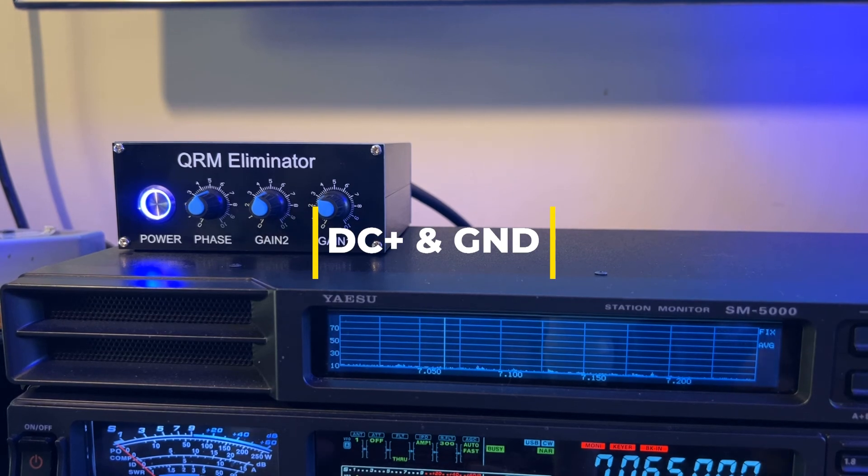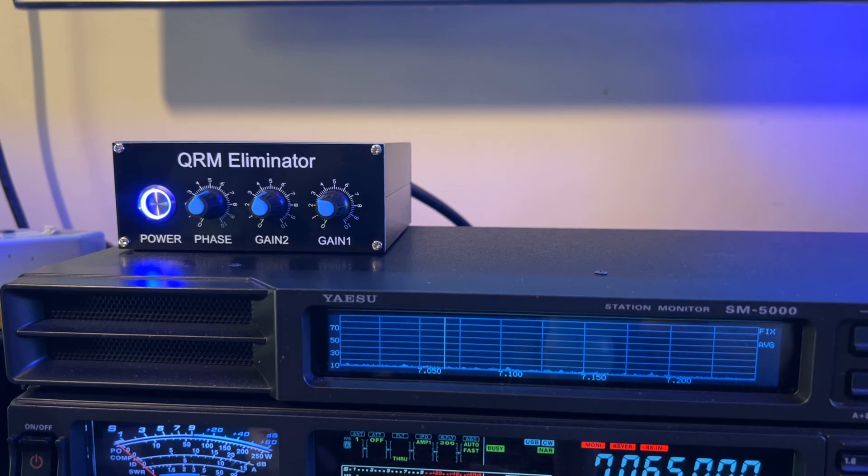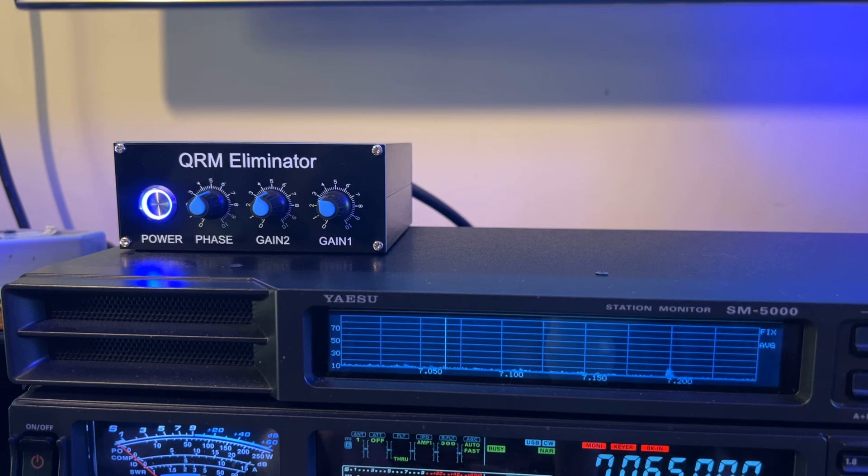I would say try to find, buy, or build a cable that can take advantage of the TX ground that is in that connector - there is one in both. That's what's keying my amplifier. The 10-pin linear port on the FTDX10 has a ground pin, and pins 1, 2, and 3 are ground, transmit ground, and volts. Those can be used to trigger the amp. The tuner port has the same thing with a different pin arrangement. You can buy cables out there - I actually have one that is a 10-pin mini DIN that only has connections for the push-to-talk lines in that FTDX10.